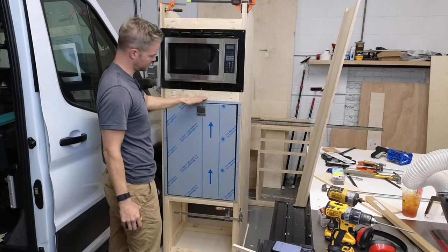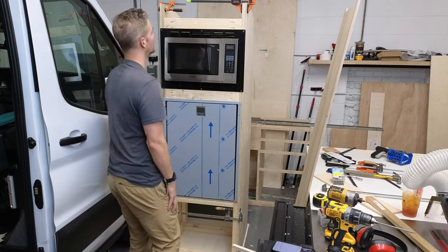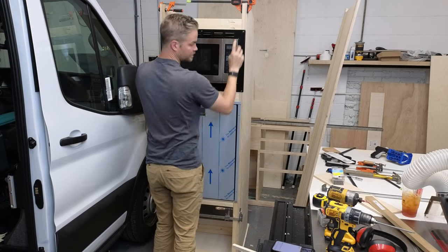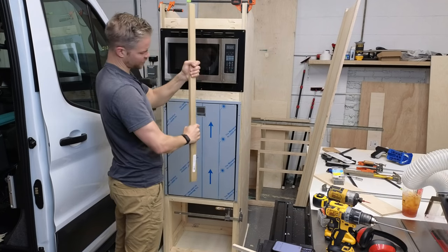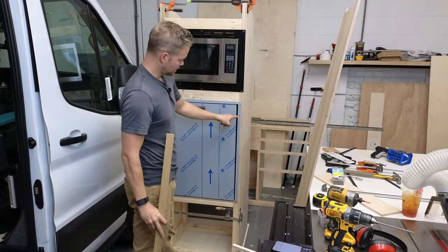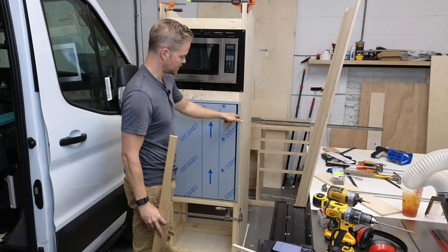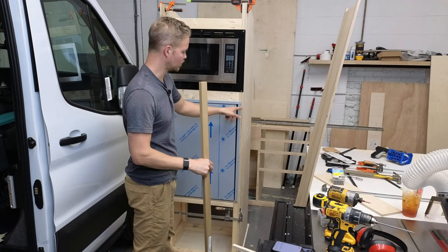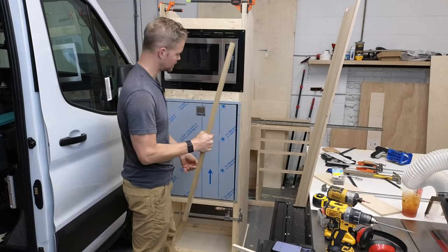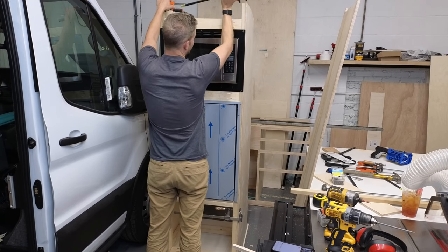And these 2x4 pieces, as long as those are cut perfect, then everything else will be perfect. These clamps are here because these pieces right here are pieces of poplar, so extremely rigid and strong, and very, very dense wood. And I want that because normally I drill and bolt this into 80-20 or some type of aluminum, but this is going into wood. So I didn't want it to go into plywood or 2x4. I wanted it to go into something hard. So this hardwood is what's gonna hold this into place. And it's gonna be wood glued, which is very, very strong.